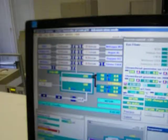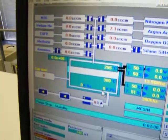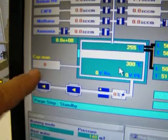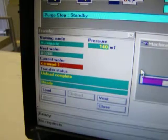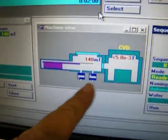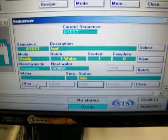The program is set up now to run a sequence. As you can see, these are the nine MFCs here. This shows the chamber, the upper and lower RF match, the capacitance manometer reading, and various valves including the throttle valve. It shows what the chamber is doing and what the system is doing. On the lower left is the transfer view, which is the load lock itself, where the substrate loads in and out. We also have a full machine view showing the chamber in the upper left and the load lock, pump valve, and vent valve. Here I've opened up a sequencer and set it up so all I have to do is push run.